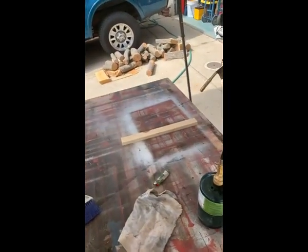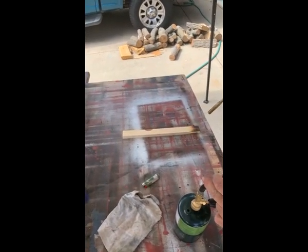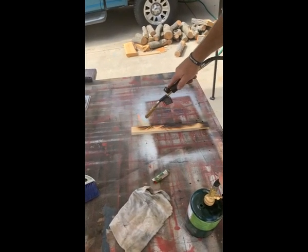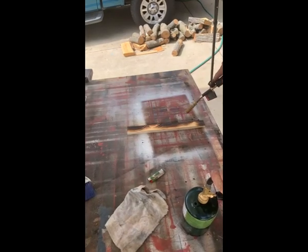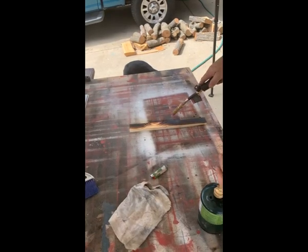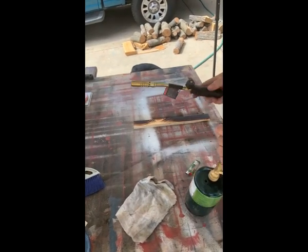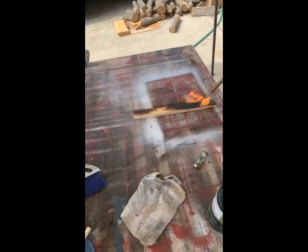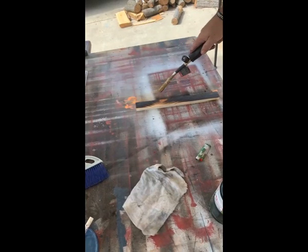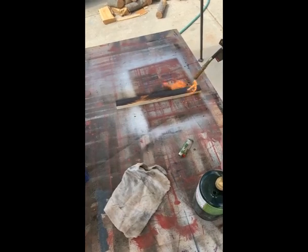On this technique we are actually burning the wood deep. We actually want the surface of the wood where we're burning to catch fire — we want it to burn down and charcoal. Your torch will sometimes do that when it is burning. I'll have her get close to the camera in a second — I just don't want her to get burned.